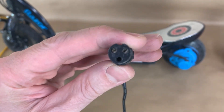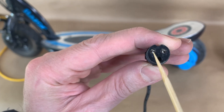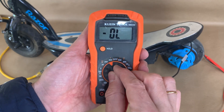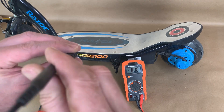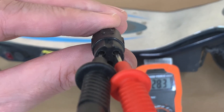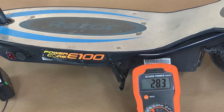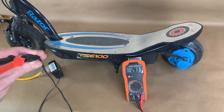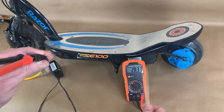This is the socket and we need to put our multimeter leads into holes 1 and 3. Let's set the multimeter in voltage measurement mode. Now we insert the leads, and it doesn't matter in which order we place them. We see that the output without load is about 28V, so our charger is probably in working condition.